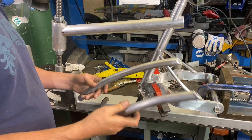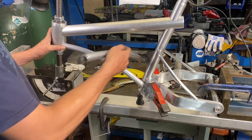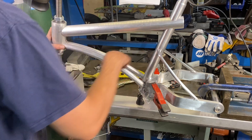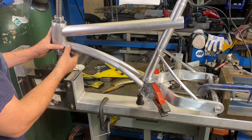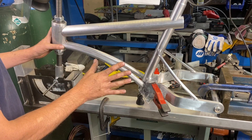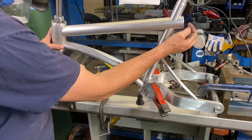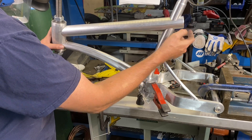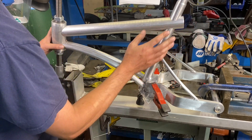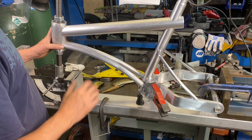Now I have both pieces cut and put them on here — something like that looks good, nice curve, and it's coped. We're going to put something here to hold that in place, then tack and weld it all together. We'll clean everything first. Now there's one more thing — I have this open tube on the end and I want to cover that. I might do that with a flat piece or press out a rounded piece. I want to close it off and get it finished before I tack and weld everything else together, or it's going to be a lot harder to do after.